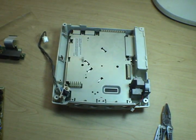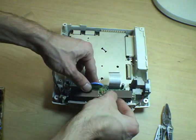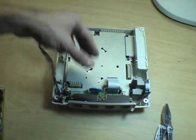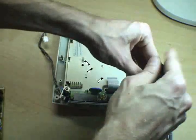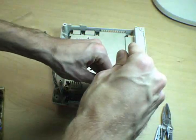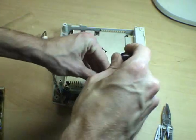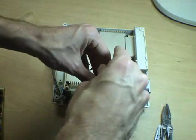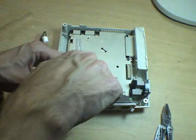And because of its modular design, it actually is really easy to repair old Dreamcasts. It's pretty easy to find them online, and there's a lot of busted ones out there. Obviously I got a busted one right here. But because of that modular design, even if you're not into replacing discrete components and whatnot, you can just pull modules out of old units if you have one that you suspect, you know, I've got a bad power supply here or a bad GD-ROM reader there. You can kind of play Lego with the thing and swap them out, move parts around, and build yourself a working Frankenstein unit pretty easily. And all you really need to do to take most of the modules out is get your hands on a Phillips head screwdriver and away you go.